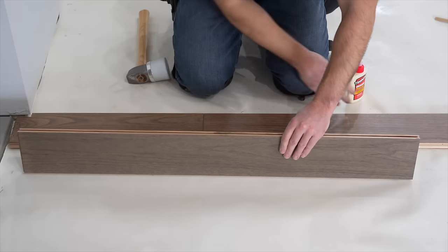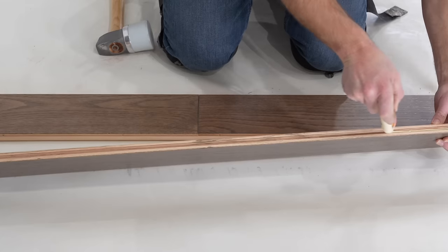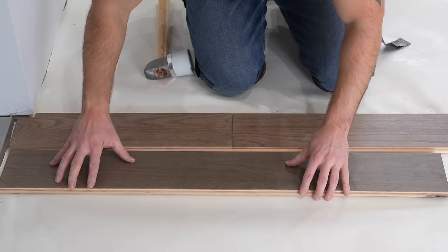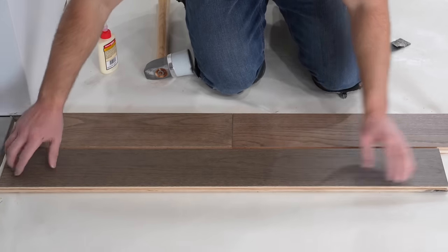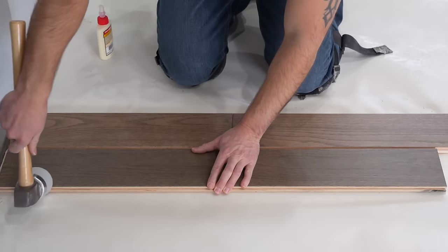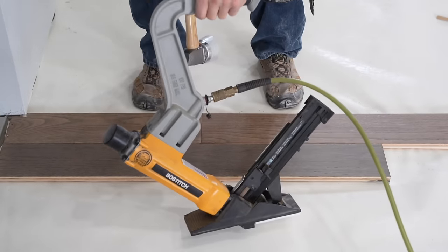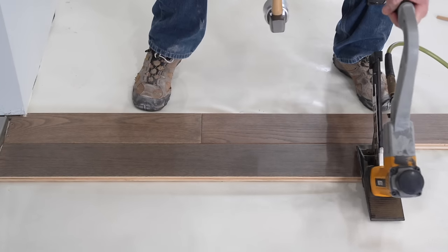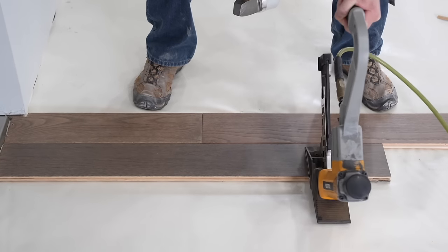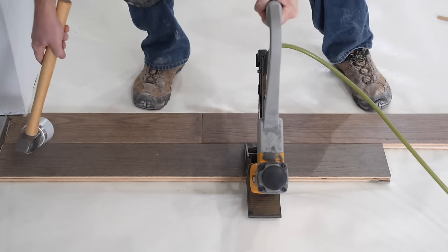When installing the next piece of flooring going into the slip tongue, put wood glue down into the groove so it bonds really well to the tongue. Line it up to the edge, allow three-quarter inch spacing from the tile, and line it up with the adjacent piece. Take the rubber mallet and tap it into place. Once tapped in, use the flooring nailer starting about an inch and a half from the edge — hit the end of the nailer with the mallet, then come over about six inches and place another nail, and keep running it across the whole new piece.